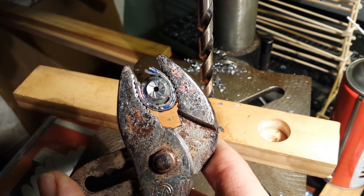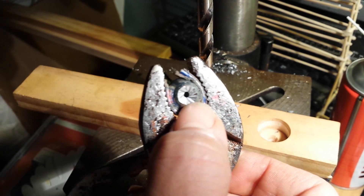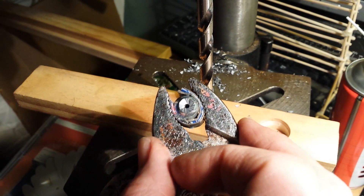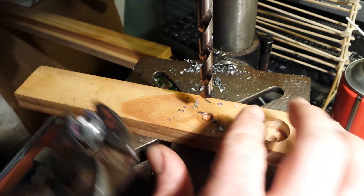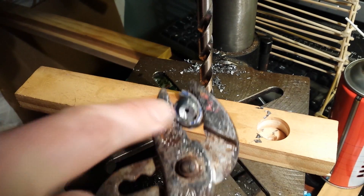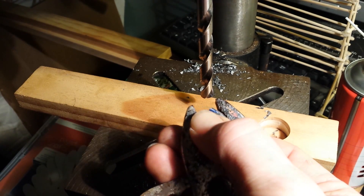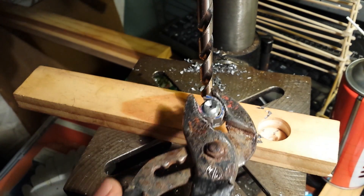The first cut was pretty alright. You can see how it's wobbling all over the place with those different marks on the inside, but once it comes to the full diameter of the drill bit it will steady itself and be a nice clean hole. What often happens is the wobbling pushes it around and suddenly it's trying to drill in on the side, which messes everything up. So I stop and check, re-push it back to centre, and then continue.